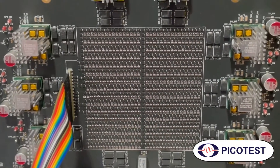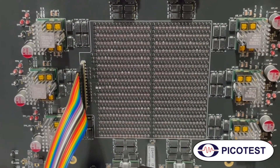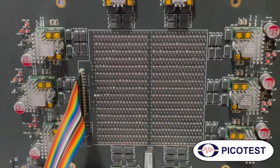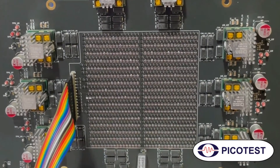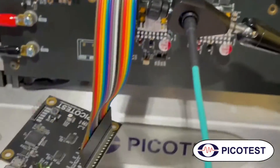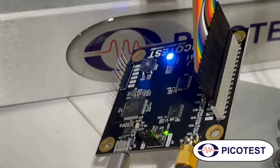We designed the power supply, but we don't sell power supplies — we're building the ASIC emulator in the middle. There's a total of 512 gallium nitride load cells, all identical. They come out through a digital bus controller, all time-matched with meander lines and fan-out drivers, to a 12-bit control line that decides which switches to turn on when. That comes down to a microcontroller — a Microchip DSPIC 33C, which right now is the fastest processor. We're outputting data at about 66 mega samples per second at 11 bits, which allows us to control that load from 0 to 2,047 amps at 1-amp resolution.